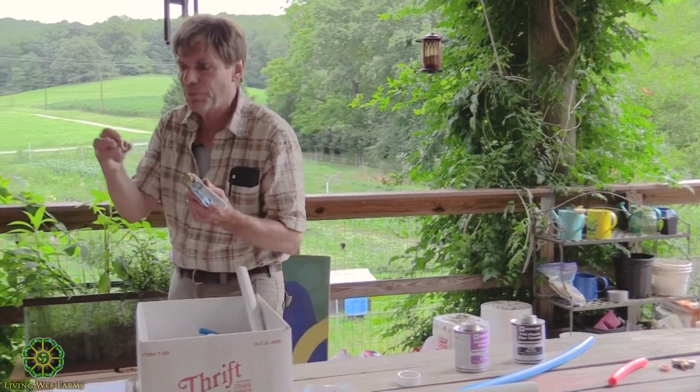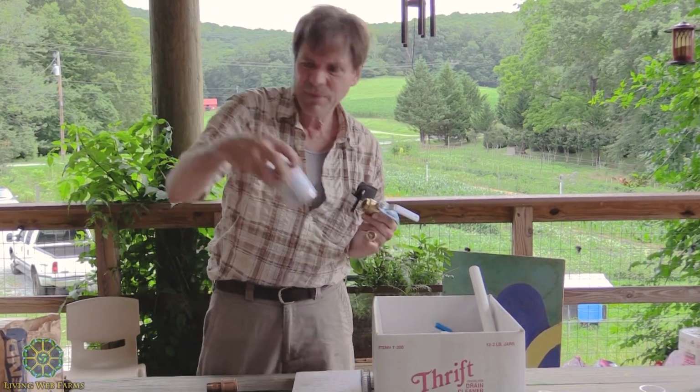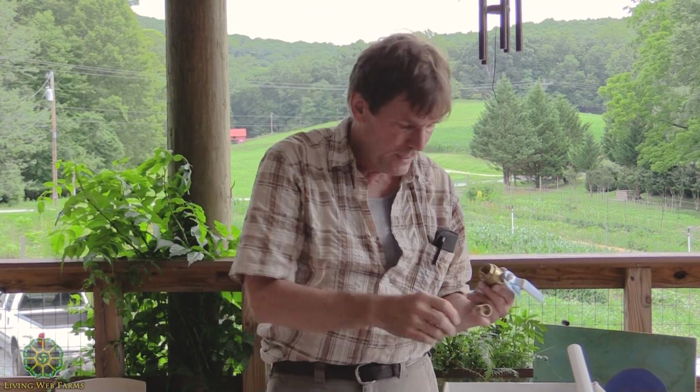In the old days, they used to put a goop on here, and I have it. I don't know what happened to it. Oh, here it is. It's just a really nasty glue. Not only does it stink and it's not healthy, but it's just messy. I just wanted to show you that we have it. And in some cases, like gas piping, you do have to use that. But for plumbing, we would just wrap. This is Teflon tape. It's really cheap.